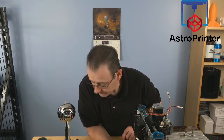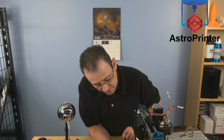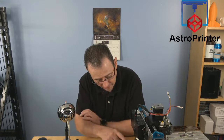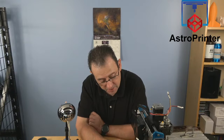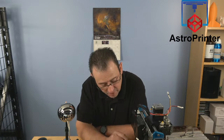And once I plug it in, with the color black to black here and then red to red on the other side, which is against what the connector is supposed to be connected, it started working. So they need to change that wiring. It's actually a 90 degrees counterclockwise turn and replug it in, and that fixed the issue to line the wires up. So they need to actually fix that. It's a QA issue on their side.